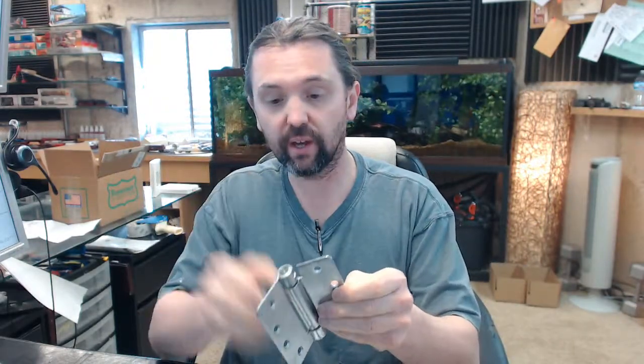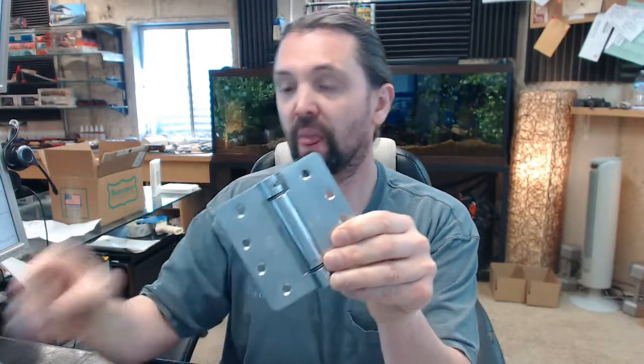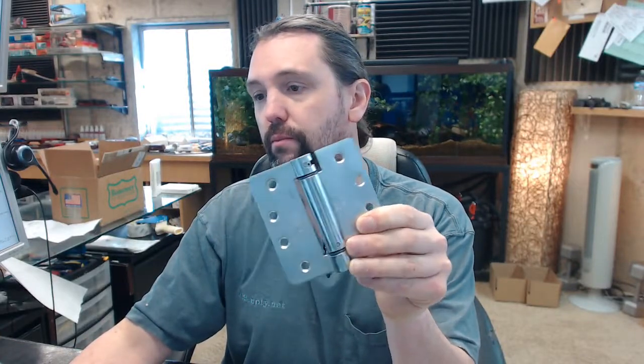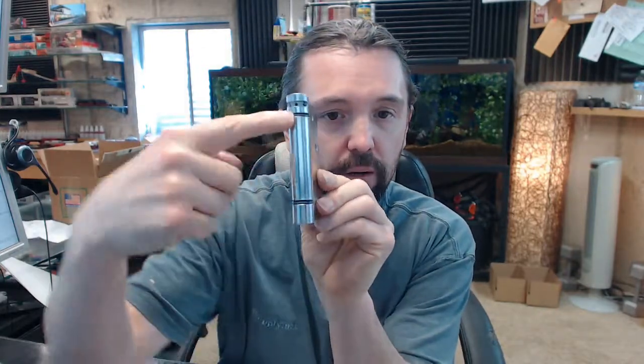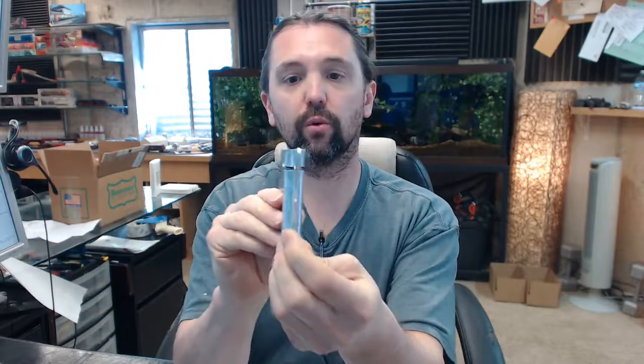So this being a spring hinge, which is going to be used in residential applications, garage door, an attached garage door. Those doors are typically 20-minute fire rated or greater, but 20 minutes is pretty common. And that door needs to be self-closing, needs to be self-latching and self-closing. The hinge does the self-closing part. Those installation instructions show you when you install the hinge with the tension collar towards the top of the door. This can work for a left hand or a right hand door.